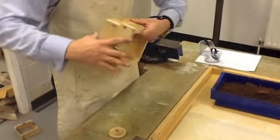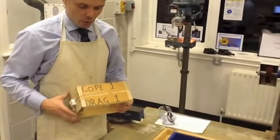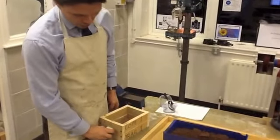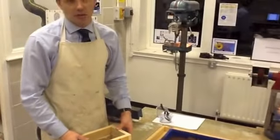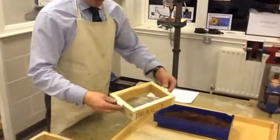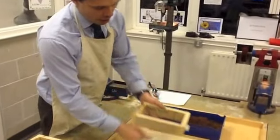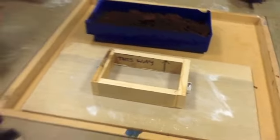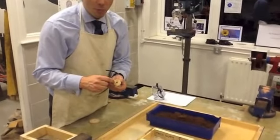You'll notice there are two halves to the mould: what's called a drag and a cope. The first part we're going to create is the lower section, called the drag. An easy way to remember this is that if you were pulling the whole mould along, the drag is the lower section. We get the drag and turn it upside down — you'll see arrows on the inside pointing upwards. So we're going to mould the lower part of the design first.